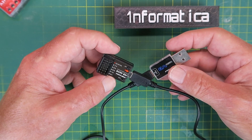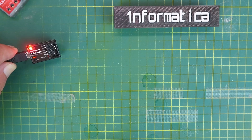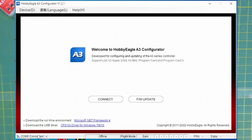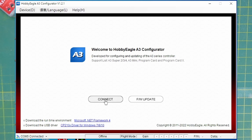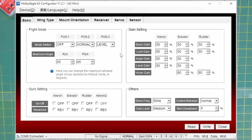Let's move across to the computer and I'll show you the screens. I'll provide links in the description to where you can download the configurator file — it's very straightforward to install. Plugging my USB adapter in now, we get a sequence of lights on the A3 Mini and then it goes into a flashing red LED. In the configurator, down at the bottom of the screen we can see the COM port assigned to the USB device. Once we select that and click connect, it communicates with the gyro. All the values have been retrieved from the gyro itself and at the moment it's in its factory settings.